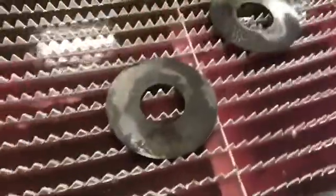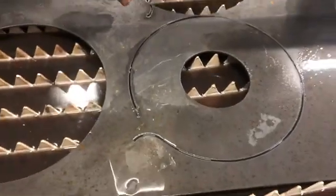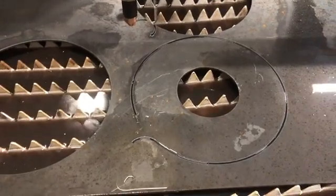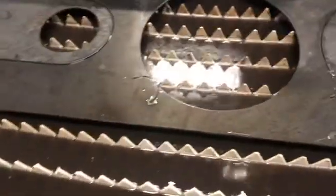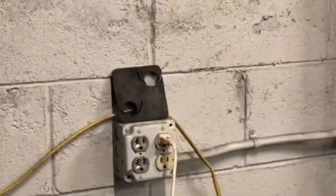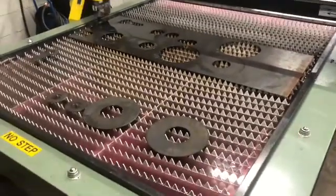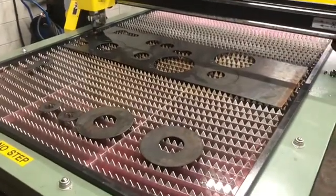I definitely have some more learning to do. I was able to successfully cut these two giant washers out, but when I tried to duplicate it, the torch height wasn't set properly and it started arcing before it was close enough to cut. So this one didn't come out the same. I was able to cut this one and that one, and this is my first cut piece ever — it's a hot mess. I gotta do better than that. I've been playing for one day. That's about $60 worth of metal I just burned up practicing. Guess I need to find some more scrap.